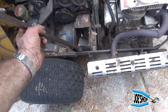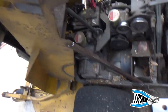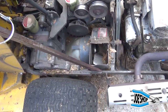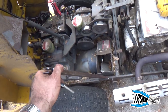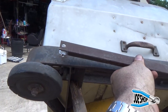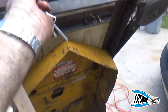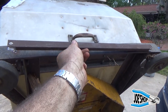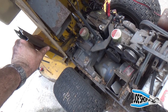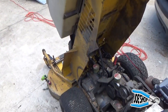Not the most complicated thing in the world — it's just a hood prop. It will sit there and get a pin that drops through, and the pin will latch over like that so it shouldn't go anywhere. I didn't measure this; I just got lucky. There were two holes in the back of the machine and they happened to line up perfectly with the holes I drilled. I have two of these pins that will drop through and hold this on the back of the machine so you can carry it around. I couldn't swing it forward without impingement from the bolt and nut, so this will keep that prop rod with the machine.